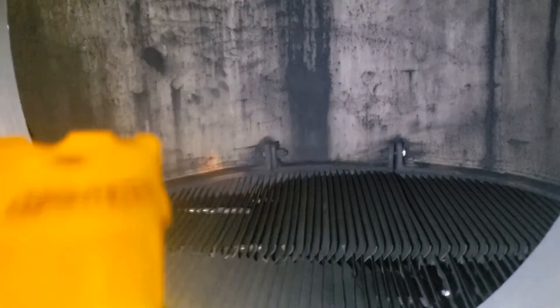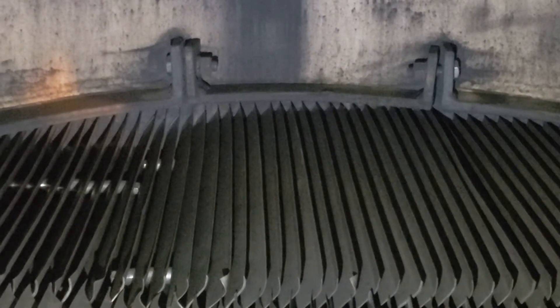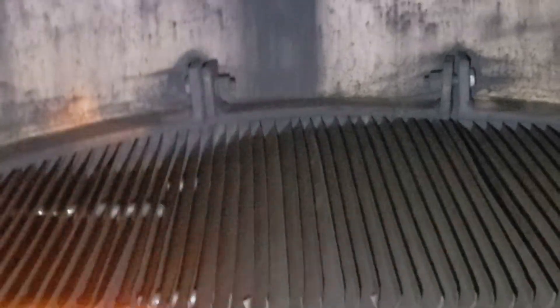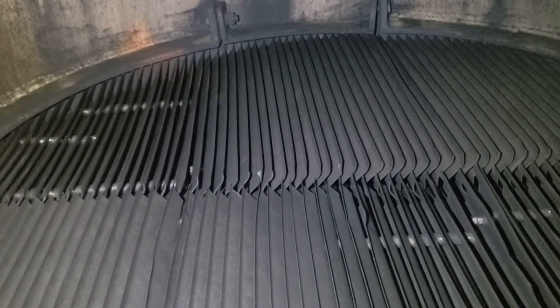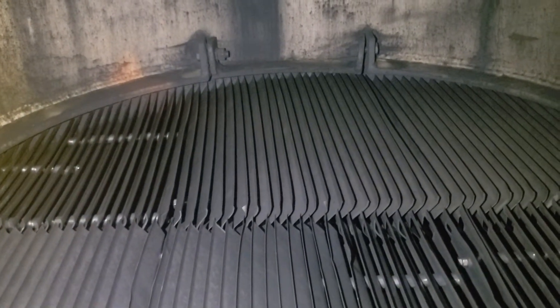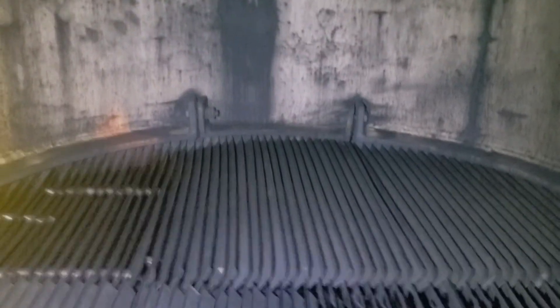It's a vertical drum. We've got the manway open and we're going to look in here. It has a moisture eliminator — a lot of people call them demister pads, but it's not a demister pad. It's actually a vane style moisture eliminator. The moisture hits the vanes and eliminates the moisture. It works just like a demister pad, but instead of being made out of a woven material, it's made out of fixed spaced vanes. Most of these you see are Koch-Glitsch type vane style or chevron style moisture eliminators.